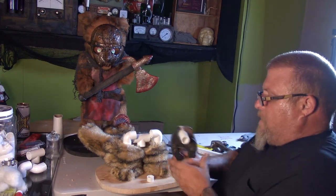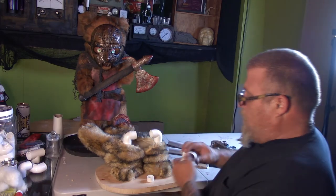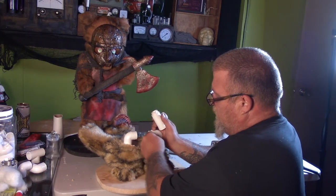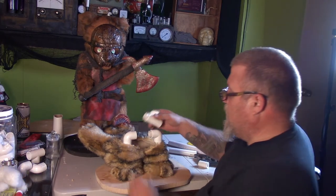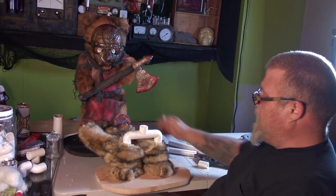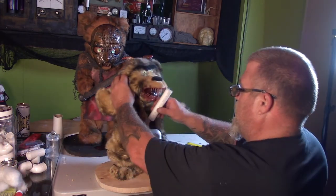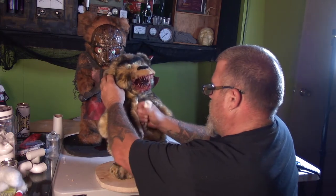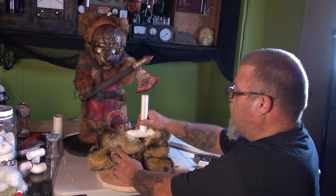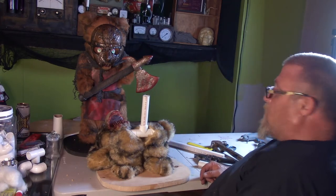There we have our legs. Now I need my two 90s — I'm just going to loosely fit them on there. I need to run for that T, and that's going to be tight, super tight. So what I'm going to need to do is cut a super small insert to go in between there and finagle it to make it come together. This is where you're going to run into — you've got to dry fit all this stuff before you do any kind of gluing. Make sure everything goes into place. You don't absolutely necessarily have to glue this if you don't want to, because as long as you're careful with it, you're going to be able to use it for some articulation.